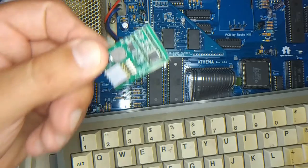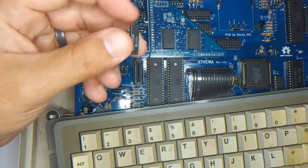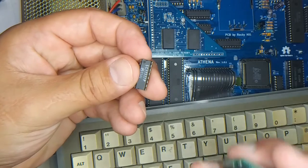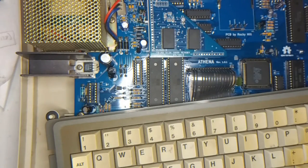What does this do? This replaces the salt chip, which is on the CoCo 2 and the CoCo 3. For reference, here is the salt chip — the standard 16 DIP package — and here is the pepper board. The salt chip stands for Supply And Level Translator. It is responsible for supply regulation, RS-232 interface level translation, cassette read operations, and driving the cassette relay. The pepper board has been designed to replace all of that functionality.